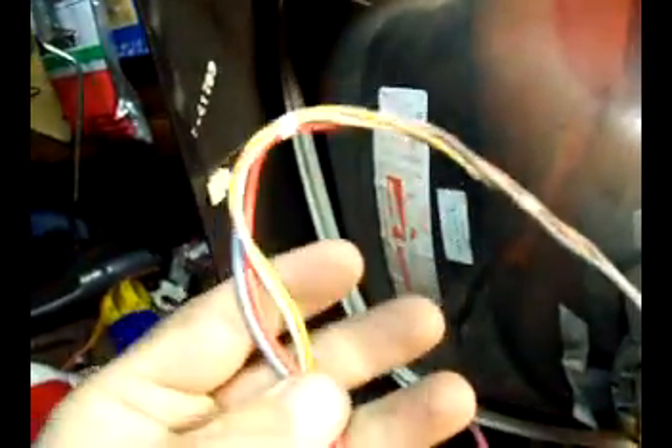There's one set of coils that does a horizontal sweep and another set that does vertical sweep. Basically, you get your high voltage here into the picture tube, it strikes an arc and helps light up the picture tube, and this is what helps sweep the image you see on your screen. If you were to reverse the polarity of these coils, it would make the picture show up upside down — essentially like flipping the television set.